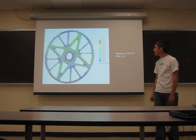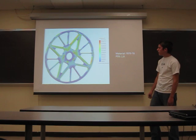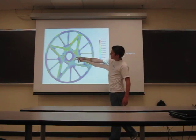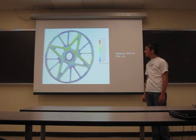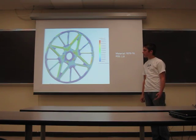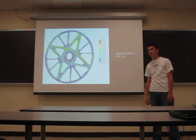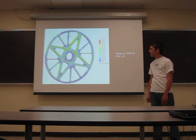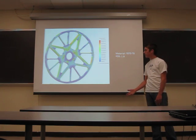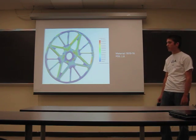My sprocket is a similar design to last year. This year we moved to five bolts in the differential due to problems with shearing bolts. My guess is that we haven't been torquing them down properly because the threaded holes in the diff are aluminum — we don't want to tighten them too tight and strip the threads. So we're going to helicoil those holes so we can tighten them down with proper torque specifications and have the shear strength that we need.